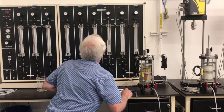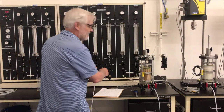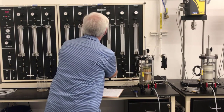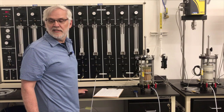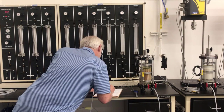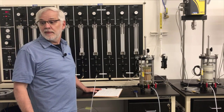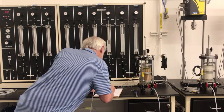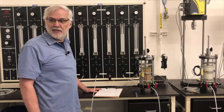And let me check my current pipette reading. It's reading 18.3. I'm going to start in 5 seconds. All right, I'm going to open those up. Okay, this is all looking good so far. And I got time to take a 15-second reading. I'm just watching my clock over here. I'm going to get a 30-second reading. I get my 1 minute reading, and then I'll talk to you.